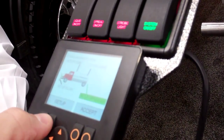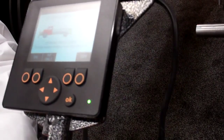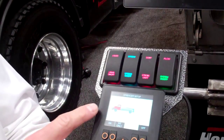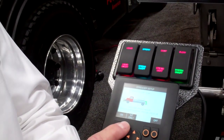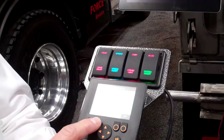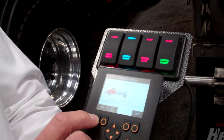I'll set up the spreader — I press setup and I choose the model. This happens to be the Henderson FSM series, so I punched that. One of those features similar to the larger municipal units is a ground speed mode. With the spreader system you can turn that off and just use it like a basic spreader, or use interrupt-only mode, in which case you still manually control the spreader speed but it will automatically stop when the vehicle comes to a stop. And then there's also the full ground speed mode, which adjusts the spread rates based on the actual speed of the vehicle.